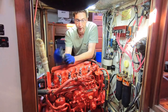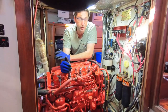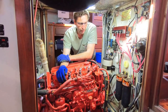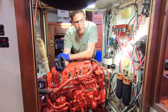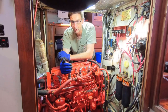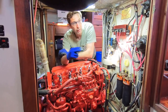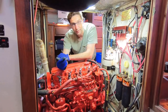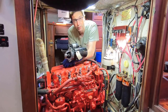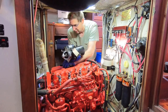I had some advice from a friend back in Canada — Vic guided me through some steps — still didn't have any luck. Then I had a mechanic come out who spent two hours on it and couldn't get it started, but I certainly learned a lot. There are some glow plugs I didn't even know were there, and we got that all figured out. It still didn't start — very slow cranking. We tested the batteries with a load test, and the mechanic even took the battery out of his dinghy and connected it directly to the engine. Still no luck, still cranking slowly, similar to a low battery — but there are two really large 8D batteries plus that third one. I've now taken out the starter and had it rebuilt, so I'm just about to put it back in. Hopefully this will give enough cranking speed that everything else should be good.